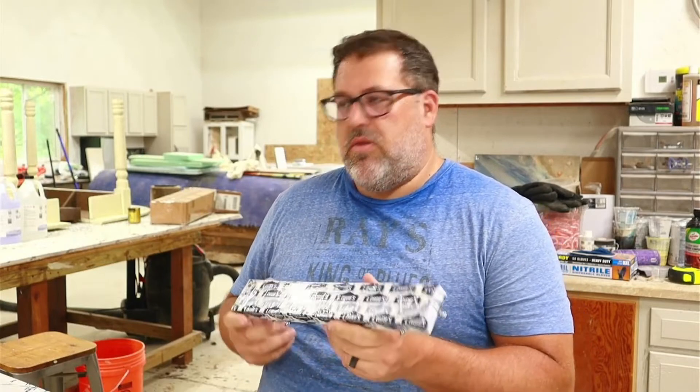The measurements are going to be different for everyone, but whatever the longer side is, you just need to add an inch and a half so the form reaches the whole way out to the outer edge. For thickness, I knew I wanted my charcuterie boards to be about three-quarter inch thick finished. The base of my form was also three-quarter inch thick, so I went three-quarters plus three-quarters for the charcuterie board thickness, then added about a half inch so I wouldn't accidentally flood epoxy over the top of the form.